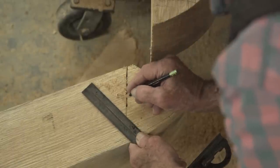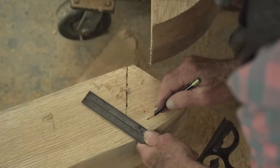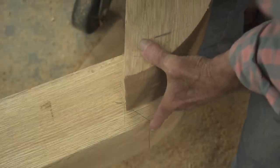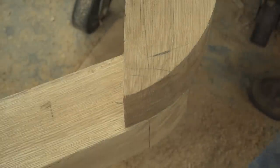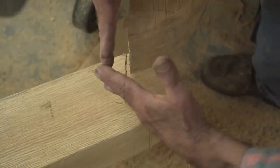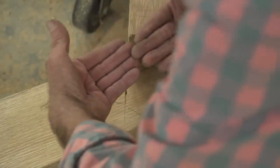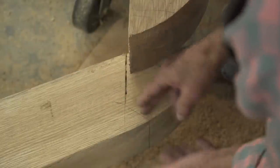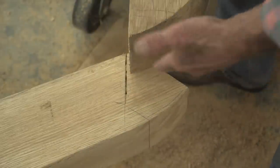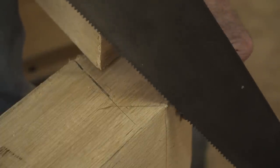The rabbet line will be either back here or here so it ships over, and the stopwater will be on this section. I want this to be just perfect. I'm going to bring this into position right here and bob this end off because it's going to have to fit in this little slot — an open notch. When I bolt it, it keeps the two pieces pulled together and lined up because those 90-degree cuts won't allow the thing to twist. That's an improvement on a standard setup like this with a gripe.